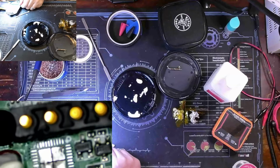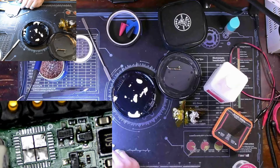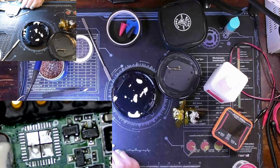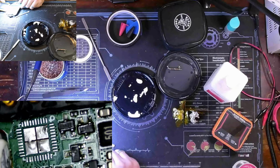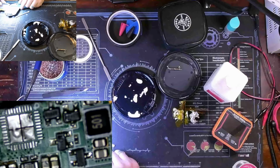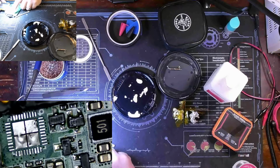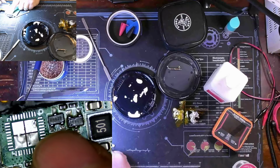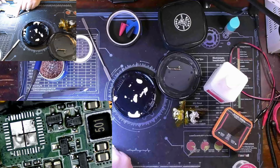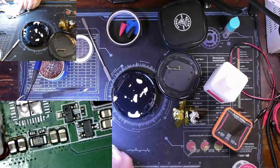I think the aluminum foil and tape worked pretty well, minus that one spot right there. But I think I actually did that with my soldering iron, trying to get some low melt solder down on those back pads. But it came off okay. I had put my hot air station set to 700 and airflow of 50. Accidentally popped off that transistor right there, or power regulator. It's either transistor or voltage regulator, but was able to easily put that back on. But everything looks pretty good.